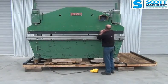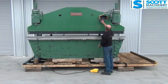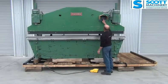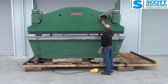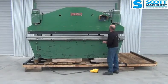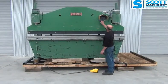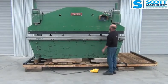And if I want to program a measurement in or change that, I go to the number 1, for instance, push data, change the figure, then push auto, manual, go, and then it goes to that new position that's been programmed in. Now the auto cycle, push auto, and then go. So that's taken me to number 2, which is 290.